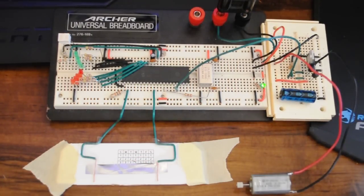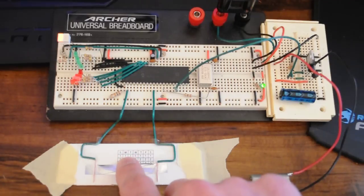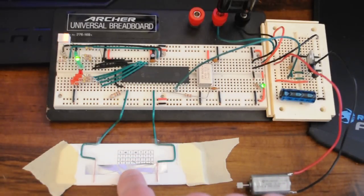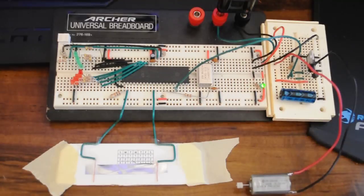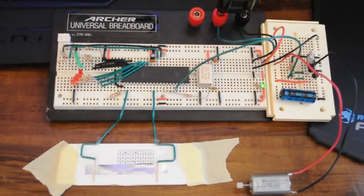And if you're developing these, I would advise cutting the diagonal like this, so that if you notice, as I move my finger up and down here, it also acts as the same speed control, but in the opposite orientation one would expect. So I have my diagonal cut in this orientation, I'd suggest cutting that orientation. And there you have it, an incredibly simple gradient capacitive touch for a microcontroller.